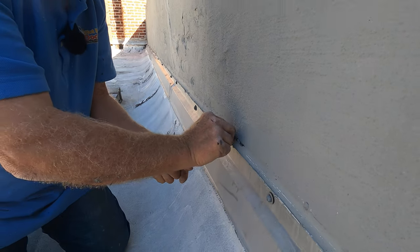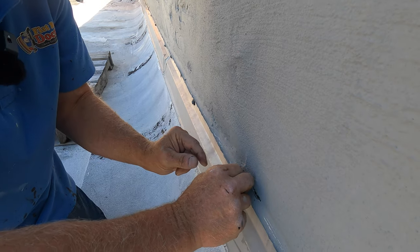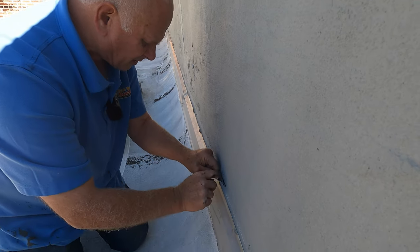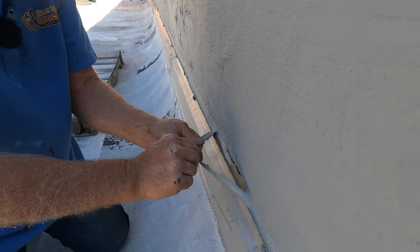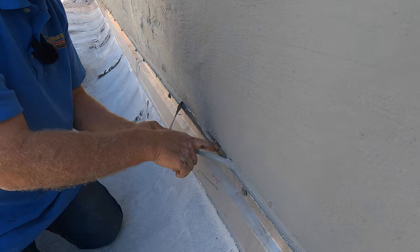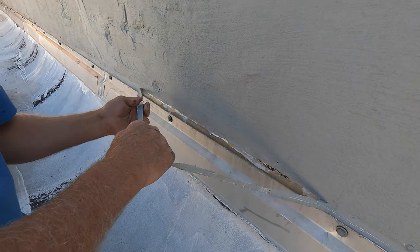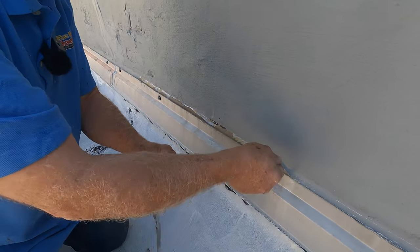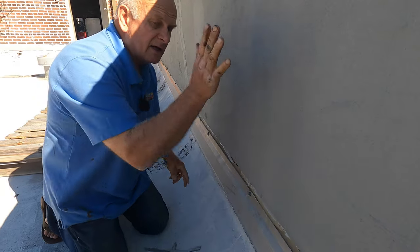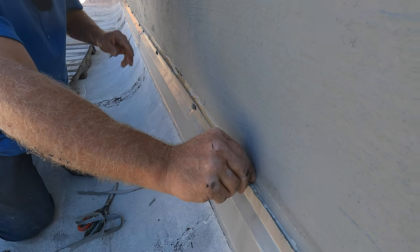Look — the paint doesn't stick. Paint doesn't stick to caulking. I will peel this off and show you. That's the paint. So the paint will crack, and the caulking doesn't stick to cement — it comes off. I'm just removing the paint. It's very good paint, but you cannot go over the caulking. It doesn't work. It will eventually crack — small cracks like this.